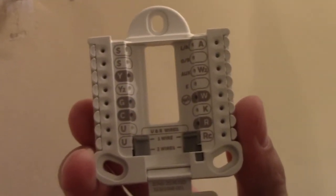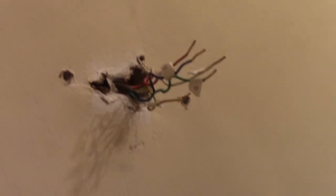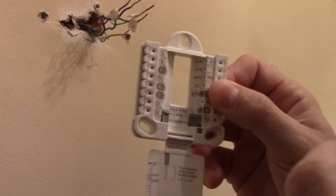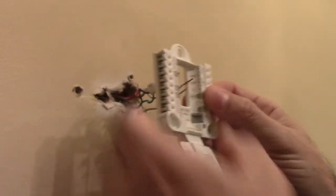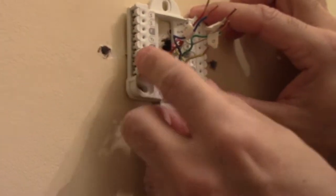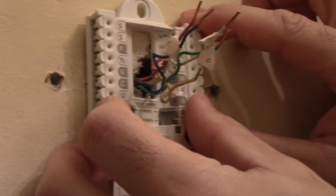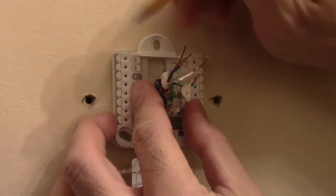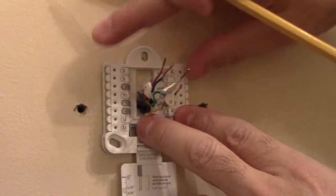The wall plate is where you put all the different wires, so hopefully you took a picture beforehand so you know exactly where they go — usually they're color coded or have little labels. The first thing is to set it up on the wall. We have these holes here we're going to screw into. You may need anchors, which come with the box. I have two holes from the previous unit I want to cover, so I center the new plate to make sure it covers them and mark exactly where to drill, aiming for the middle of each hole.